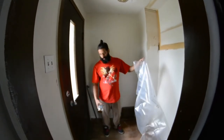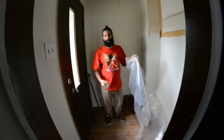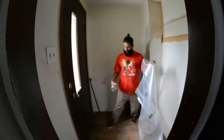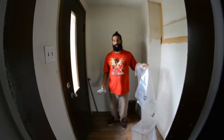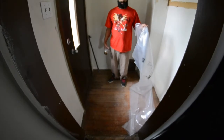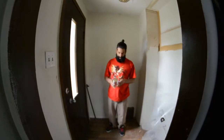Now over top of this was some laminate tile, and it was pretty garbage. So I basically got rid of it so that I could refinish this by using a belt sander. Probably going to use an orbital. Stain it with some really heavy finish, because most people that come through this door are going to come here with muddy or slushy boots or whatever. So I'm going to put this up now and get started.